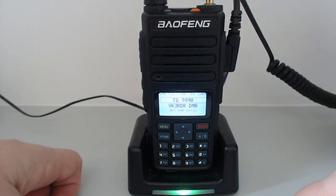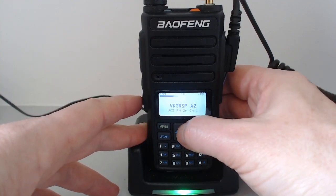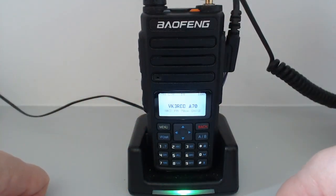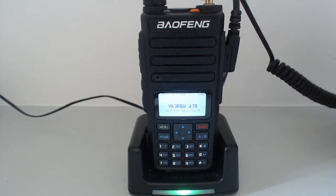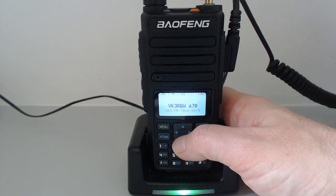So that's the DMR operation. I'll try and see if there's anybody on FM. I'll change zone and try to find somebody on FM on two metres. I'll just do a scan — probably no activity this time of day. There's nothing on 70 centimetres. One of the bugs at the moment is that in FM, every time it does a beep, it's picking up hiss from the unsquelched FM receiver chip.